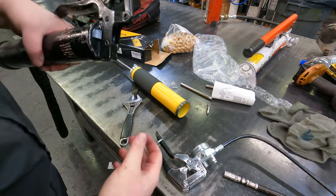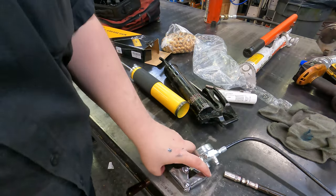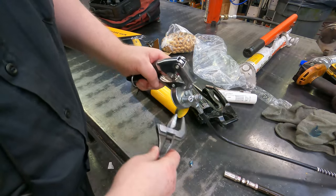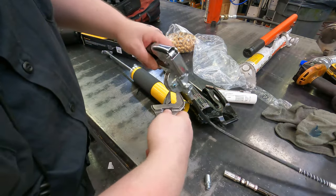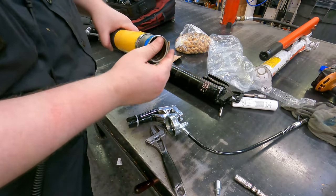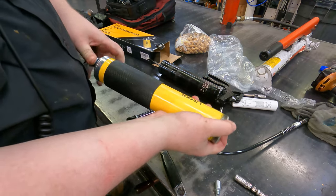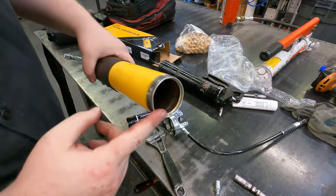I always use the old gun and salvage whatever parts I can, because every grease gun is going to have a different point where it breaks. I've had these things pop — we're talking about 8,000 pounds of pressure. So I'm going to take this off and reuse what I can. Here I have an empty tube of grease, and I'm just using this so that the seal has something to press up against. You can see the seal is now inside that tube, so now I can fill this up.